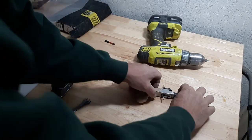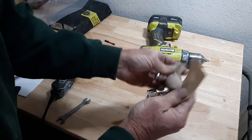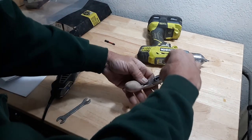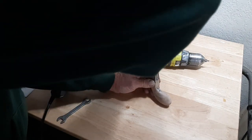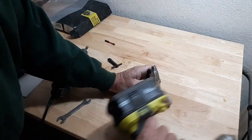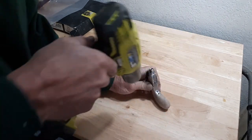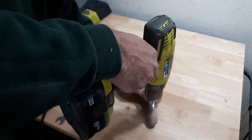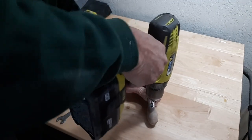I've got the handle. I've just spent a while with the Dremel and a little bit of work with the fine sandpaper, got that almost to where I need it. Afterwards I'm just going to give it a good coating of linseed oil or something. I want to get the handle out of the road, trigger out of the road. It's unloaded. I've got two screws to put in, but I don't want to split the wood when I put these screws in, so I want to give it a very tiny pre-drill.